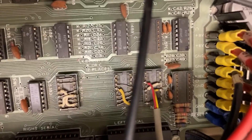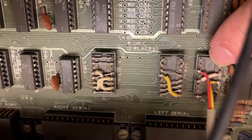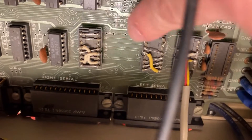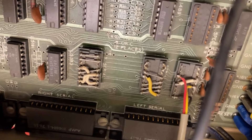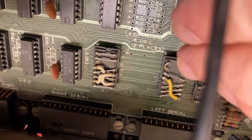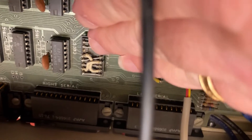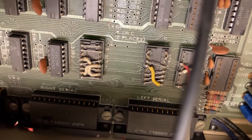I noticed there are a few just straight-up hot-wired connections. This is fairly typical of what you'll see on an S100 bus card, where people will create different jumpers for different settings for things like baud rate, number of stop bits, or various other things. So often in an S100 bus, the IO ports in use will be mapped to different ports depending on how jumpers are set.